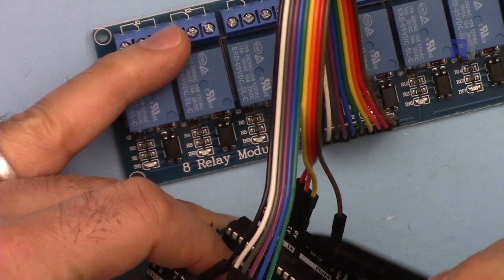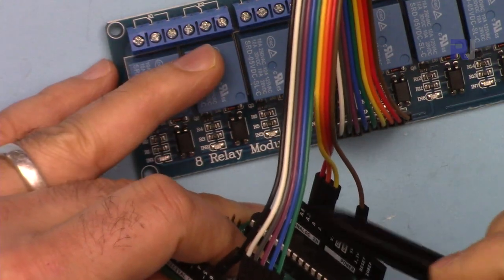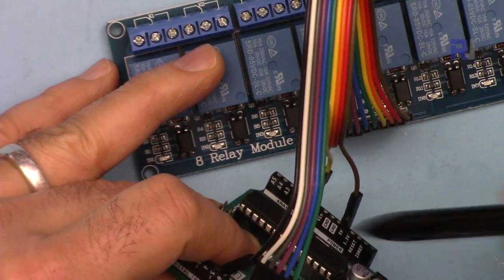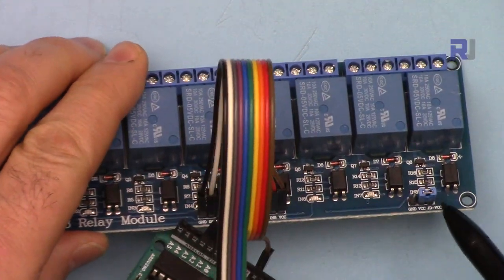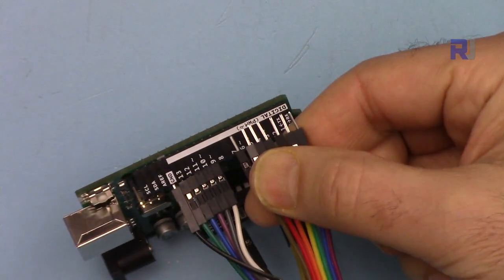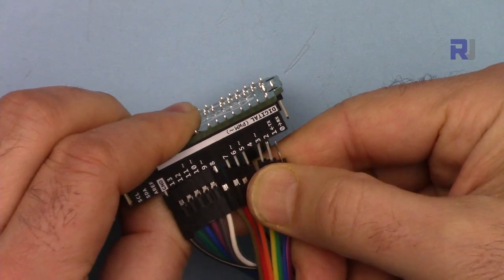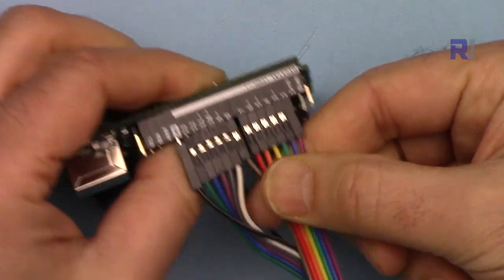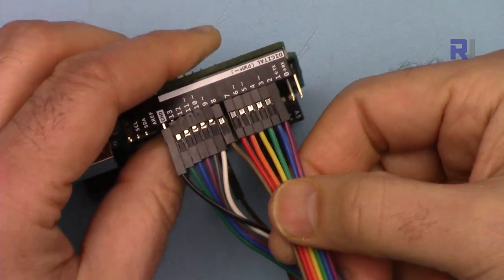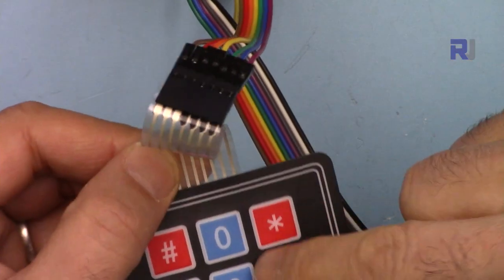As you can see the second goes to analog 1 and the third goes to analog 2. These analog pins can work as digital outputs. The last pin, VCC, has been connected to five volts. This jumper is set on the right side. For the keypad, all seven wires are in one line — I'm inserting them from pin 2 to pin 8, all seven wires connected in the same order as they are on the keypad.